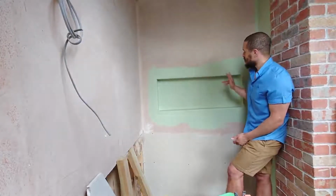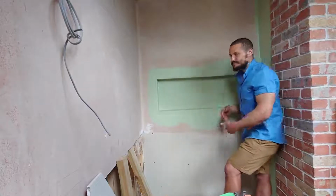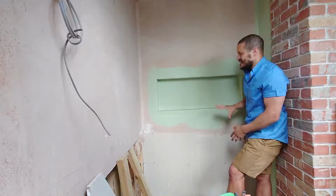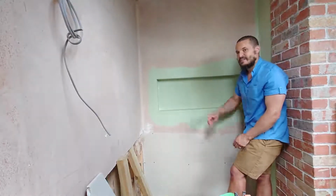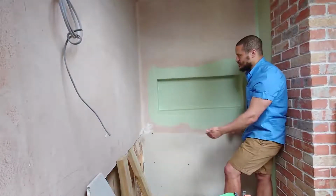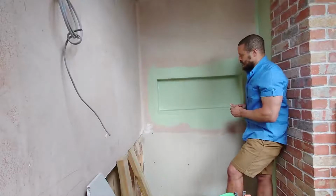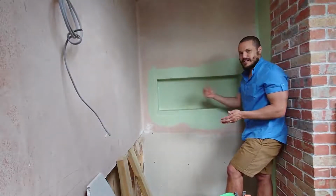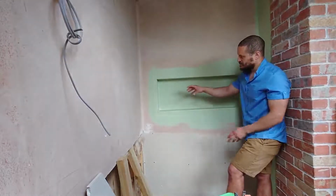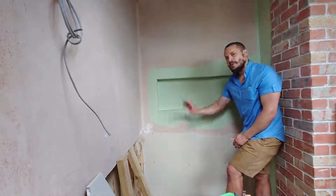I've got a 2x4 going across, a 2x4 underneath, and then two 2x4s sitting in between those, essentially recreating some of that support more than anything. The shelf itself doesn't need supporting, there's not going to be heavy things in there. But ultimately by doing that approach and cutting the whole gap, I was able to create a niche that's just shy of 1 metre now that I've added all the layers back in. Having a 1 metre niche, it's not very deep, but a 1 metre deep and wide niche is better than having these tacky shelves all over the place or shampoo bottles on the floor.